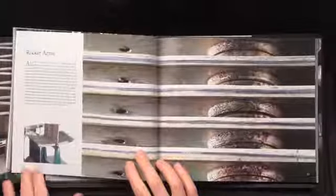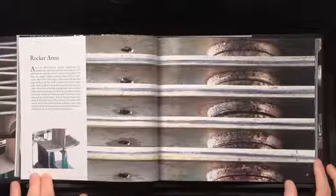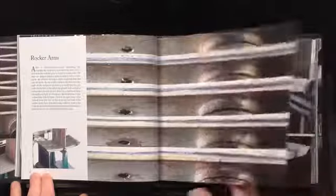Each rocker arm has 2 holes on its left and right sides about an inch away from the pivot. We're not sure what they're there for. At first, we thought that a rod could be inserted through the holes in order to align the rocker arms. This is nearly impossible without binding the rod and rocker arms. Plus, aligning the arms is more easily done by aligning the notches on the cylinder gear set. So the purpose of these holes remains a mystery to us.